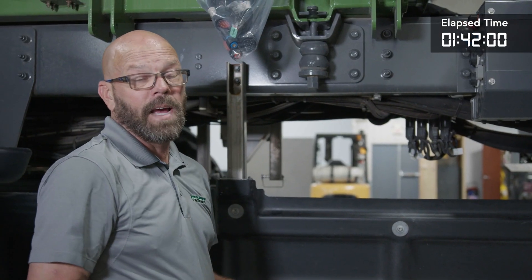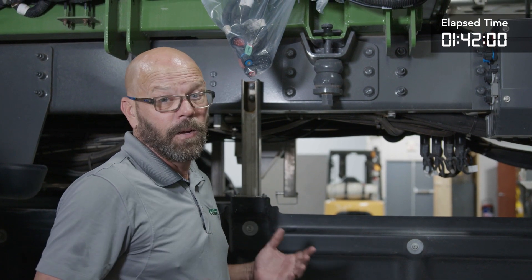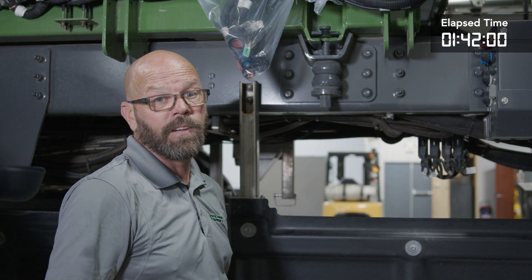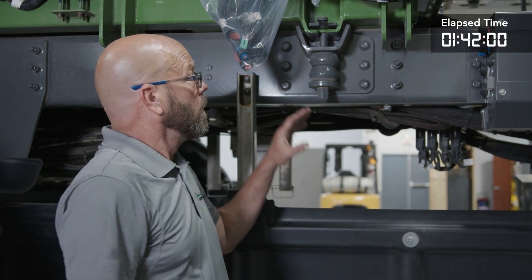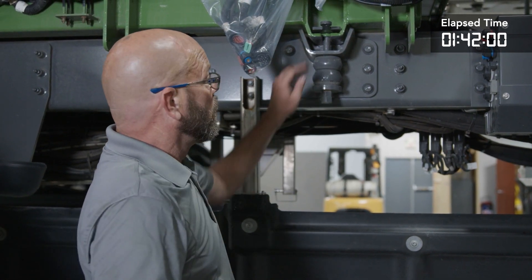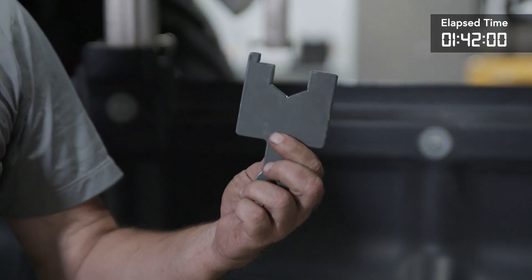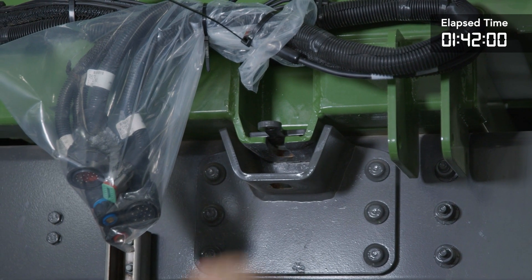On the right-hand side of the Air Max, the front tie-down spot in this position is very open. However, if we have the foam marker option added to the machine, the water tank and foam marker assembly would be covering up this area, making access to the top of the tie-down impossible. In the bag with the documents and the operator's manual, you will find the special tool used to go in and hold the top of the bolt.